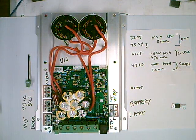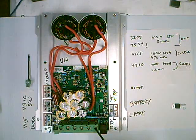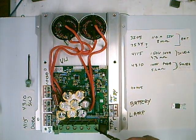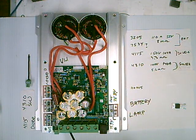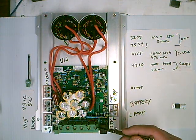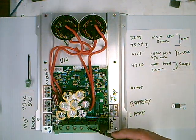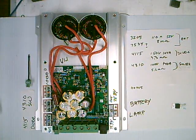This is a common ground, often called negative ground — all the minus pins are connected together. A lot of people have these controllers with the minus from the solar panels to the battery. There's a FET switch in there as the normal blocking diode, and on the output this is a high-side FET driver for the lamp, driven off the high side so it's common. This is the best way to have it — you've got a good heat sink and overall it's not a really bad unit.